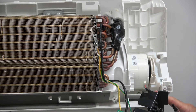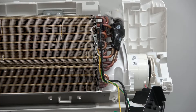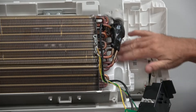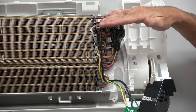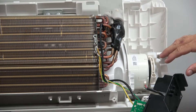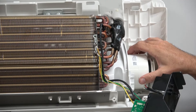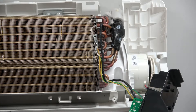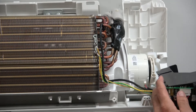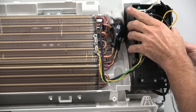Your fan motor is now accessible to service, and if it's springtime and you're cleaning the system, you might want to remove the assembly out of the way. You can wipe down the drain pan, you can pull up on the coil here and clean it all out, and if you're in a really dirty environment, you may even need to pull this out, pull your fan motor, and clean your blower wheel. It's all fairly easy and quick to do — just a matter of a couple of screws.